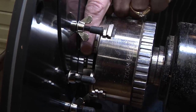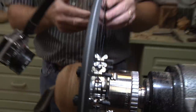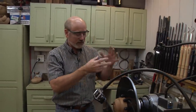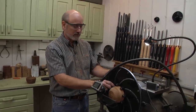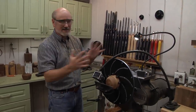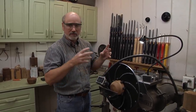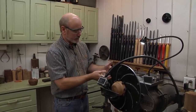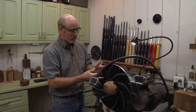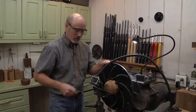You can see it's got a metal base — fits right into a dovetail, so it's held really securely. Other types have holes drilled in different increments, and you literally have to unscrew each one of the rubber things, screw it into a hole, test it to see if it fits — and there are four pieces because they go onto each jaw of the chuck, so it's a lot of messing around. The Longworth chuck is a lot easier to use, a lot faster. Just scroll it in to where it pinches up tight, tighten the wing nuts down, and you're ready to rock and roll.